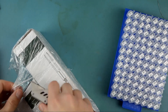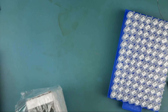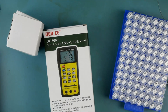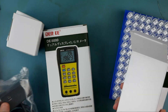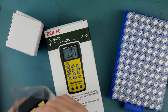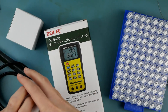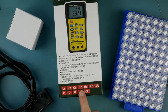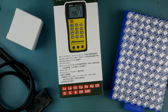So I just want to go through and test some known inductances. Let's talk a little bit about why would anybody ever need something like this — what is the point of this kind of a meter? It's made to measure inductances and capacitances. The thing that I love about LCR meters is that it usually lets you measure something that would only be a parasitic component most of the time. If you want to measure the parasitic resistance of an inductor or the parasitic resistance of a capacitor, typically an LCR meter will allow you to do that. That's LS, LP, CS, CP, RS, RP — inductor series, inductor parallel, capacitor series, capacitor parallel. It lets you measure all kinds of good stuff.